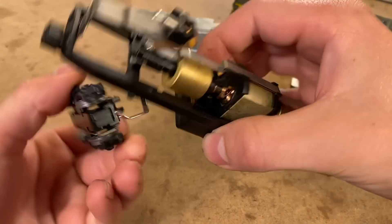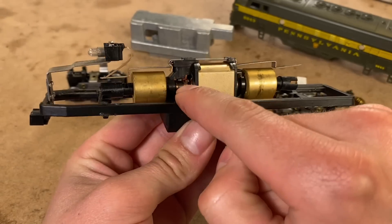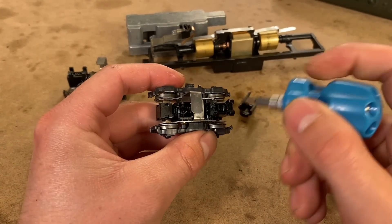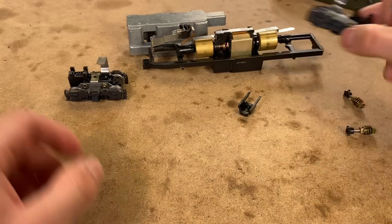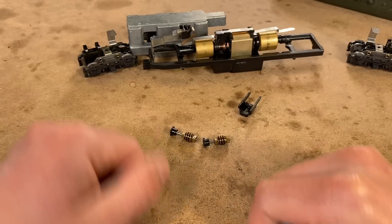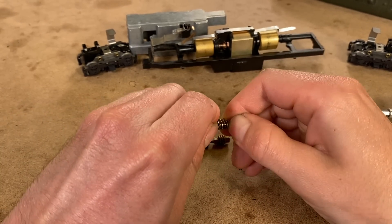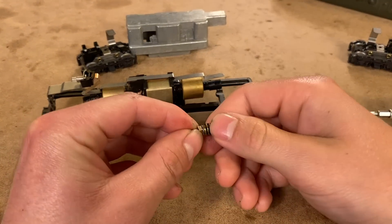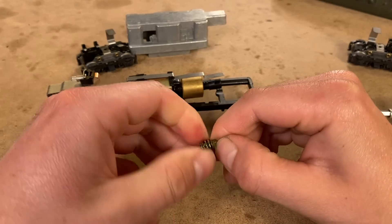This is the first time I've seen one on one of these. The motor seems to be turning fine, and this engine definitely did have some use at some point — you can see that because there's wear on the commutator. The gearboxes are turning pretty much effortlessly, so that's what we want to see. It really is just an issue with the worm gear bearings. I suppose it's not impossible that maybe at some point this engine was involved in a flood, but the motor is turning fine and it's all metal components. I wonder if there was a manufacturing problem, or maybe they used dissimilar metals causing oxidation.